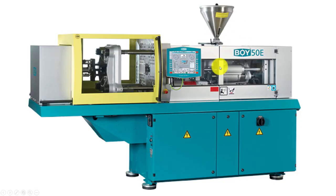What does an industrial machine look like? This is a Boy — that's the manufacturer — and the 50 represents the tonnage, which is how much force we can clamp and hold the two die halves together: 50 tons. We're putting pressure on the plastic, typically up to close to 2,000 PSI. So one square inch is going to take about a ton of clamping pressure just to hold it together. We need a little extra to keep the dies closed and prevent flashing at the parting line where the die halves come together.